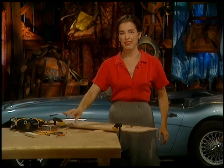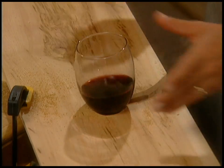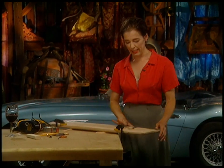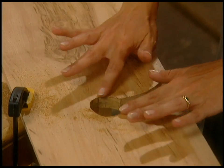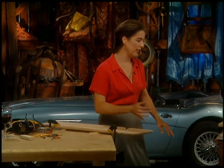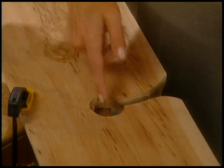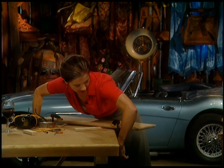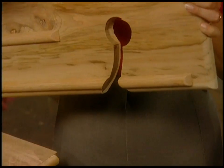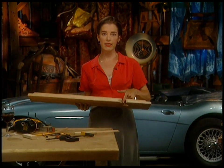Well, I've done better. I probably should have had a little of this — it would have relaxed me. It's not too bad — it might bust though, so be careful. Now see the tear-out I told you about? See how it's all frizzy, like little fuzz bits? That looks bad. So we'll be sanding that and then I have to flip it over and sand all around this end grain too. It's going to take a lot of sanding to fix that — it's all kind of hacked up. But that looks nice there, huh? That's sort of sweet.